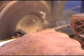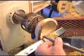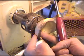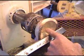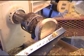Okay, so we're going in about a 45, and we're running this bevel. As we're running this tool in like this and then working it right around, we're watching our bowl thickness through here. We're watching our bowl thickness through here, and we can stop and check it. And I can feel right now that I'm a little bit thicker down here at the bottom than I am at the top. So I need to go out farther. Looking at it from the side angle here, I can see that the bottom is thicker also. So I need to start shaping my bowl now.